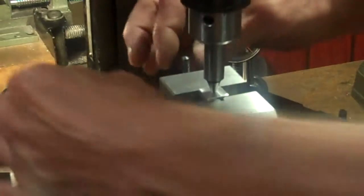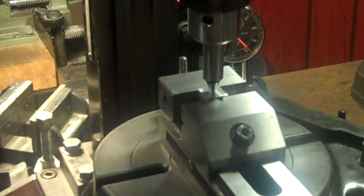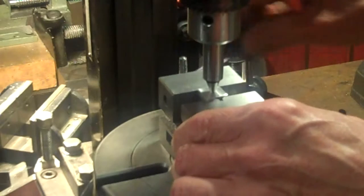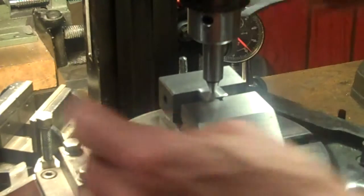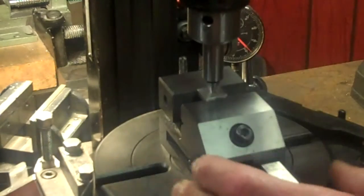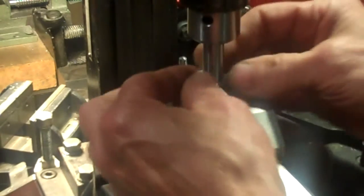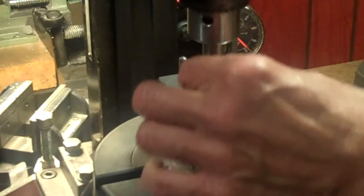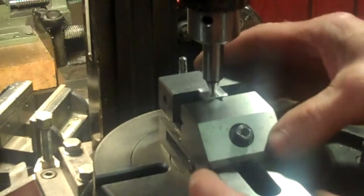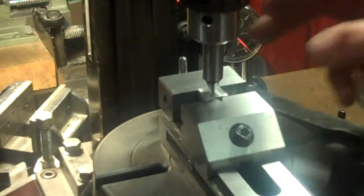And then I have a clamp back here that I can clamp to get it started here. Just to get my vise a little bit tight here. And then I'll put a clamp on this side. I can't put anything on this side because that's where my stop is going to go. It's always on the right-hand side here. But I just want to get this now. It's lined up here, so... Okay, so now I can keep on adjusting my workpiece and my vise back and forth here until I get everything concentric here where it needs to be, and then I can tighten everything down.